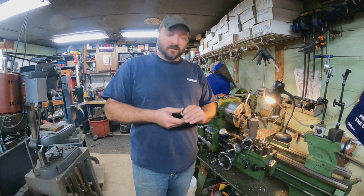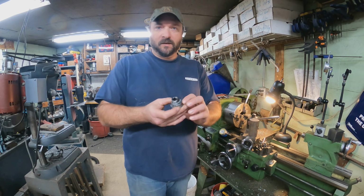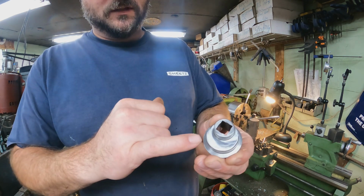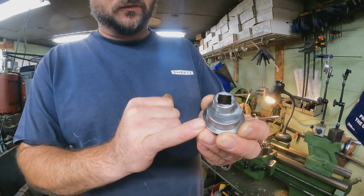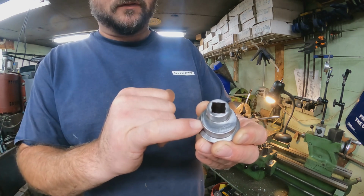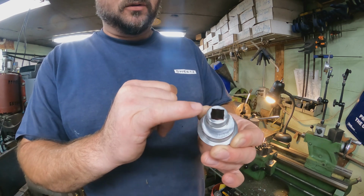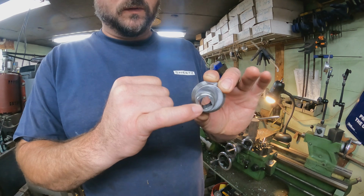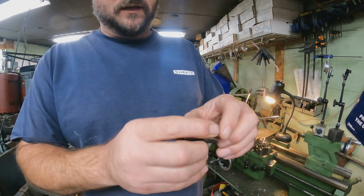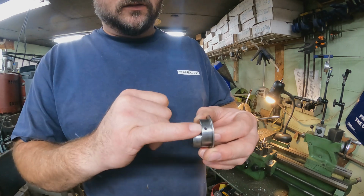So I was asked to make these eccentric bushings here. I have to make two of them, and to give you a closer look, I think the overall diameter is 1 3/4, this is 1.375, and this is a little under 7/8, or 0.841. You can also see there is a square hole broached into that. I'll check the drawings to make sure I got the right numbers there.